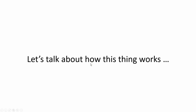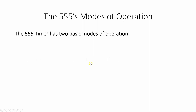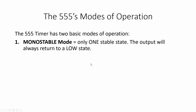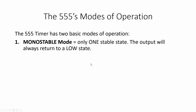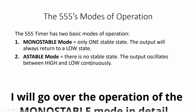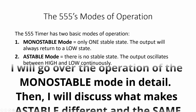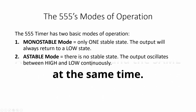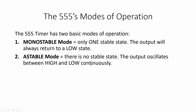Now that we have seen what's under the hood, how does it work? There are two basic operating modes for the 555 timer. There is the monostable mode, which means that there is only one stable state — this state is when the 555's output is low, and it will always return to this state and remain there until told to do otherwise. And then there is the astable mode, which means that there is no stable state. The output of the 555 will continuously switch between being high and low as determined by the timing resistors and capacitors. I will go over the operation of the monostable mode in detail, and rather than repeating this process for the astable mode, I will discuss what makes astable different and the same at the same time.